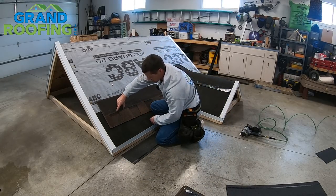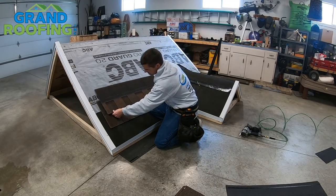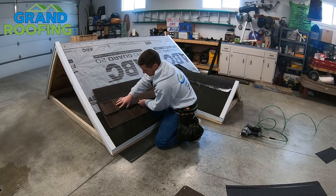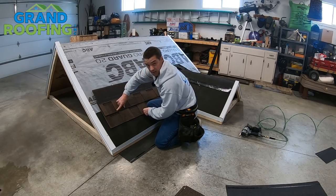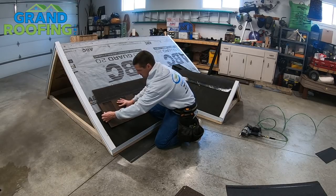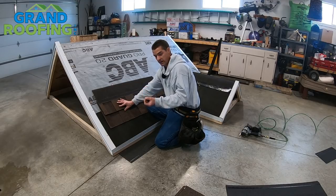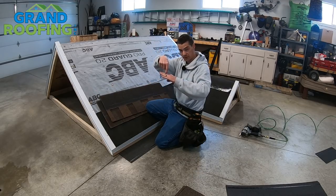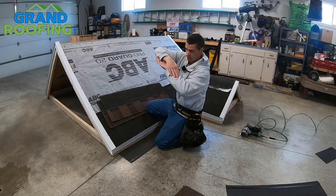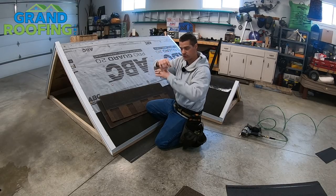Also where your nails are, your next shingle's seal strip is going to be bonding right where those nails are. If this shingle is pinned down firmly and this one is sealed to it in that area, it's not going to go anywhere in the wind. If your nails are up high, this is sealed down — you risk over time it moving and pulling, and in strong winds, over the course of time popping your nails right through. If your nails are up high, it's actually tugging and pulling with leverage and could break your nails.